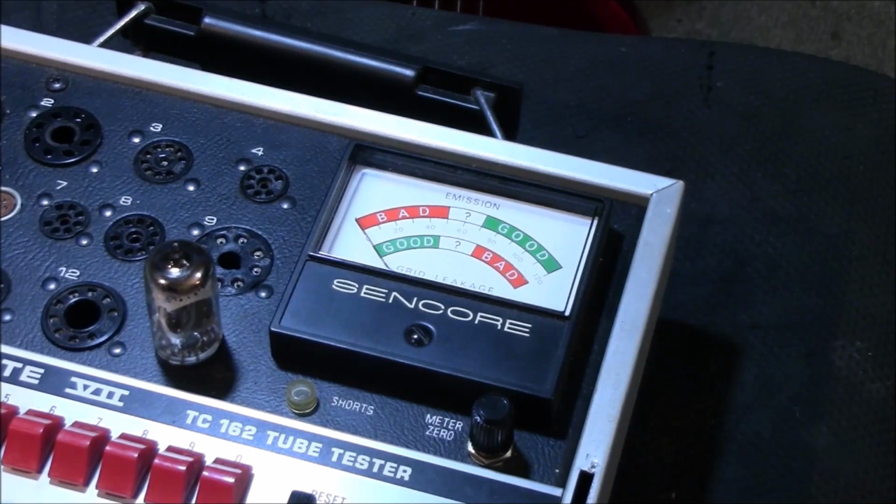Now the problem with the Comet, I've had two before this one, is that there are 5 different schematics online that claim these are the correct schematics for the Comet. And of course only one is correct, obviously, because they're all 5 different. Now, there were revisions, I understand, to this amp over a period of time, and that could be the reason for those different schematics. But only one will match yours, okay? So you've got to be very careful about that. Just don't go, well, that's what it is. And also, the schematics on some of them call for different tubes, like same size tube, but different value, and that'll screw things up, right?